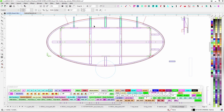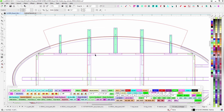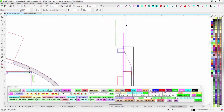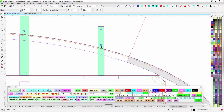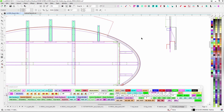So we have our basic box, and then we're adding this kind of frilly surround. And then these guys here in green will be 1/4 inch actual jigs that will incorporate through and out. And then that's how the top box regular channel letter actually attaches up here. You see there in green, it's going to actually attach to the 1/4 inch spars that are coming out, and you'll have 5/16 riv nuts holding everything together. But that's a whole other thing to jump off of.